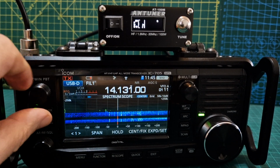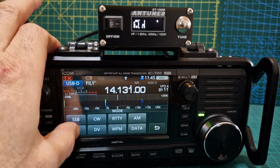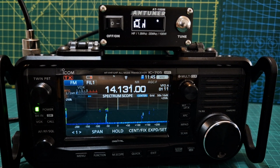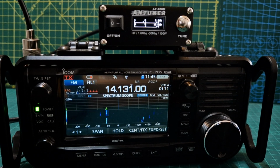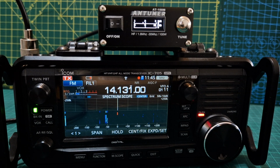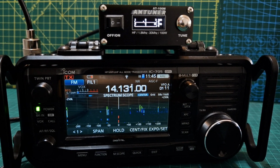20. Turn it to FM. Actually, let's check the power. Yeah, it's at full power. So let's get back to the SWR screen. There are different screens. M0FXB test. So we've got 1.72 there. M0FXB test. I wouldn't say it's the best SWR, but the wire I've got, I don't know, it should tune better than that, I would say.